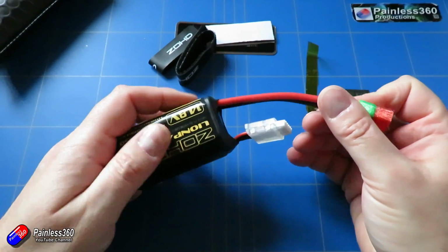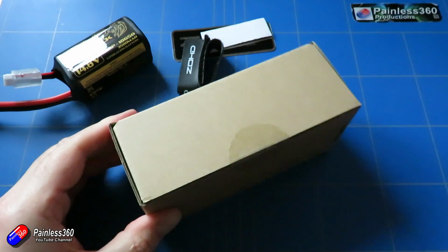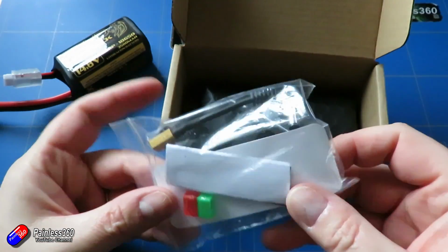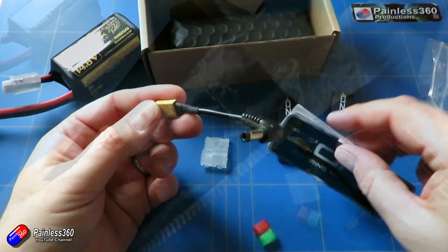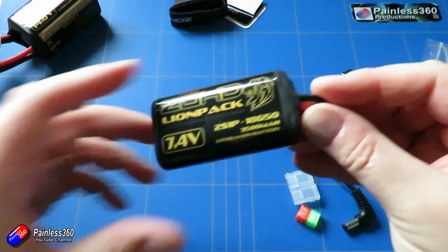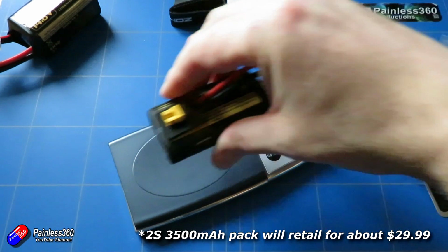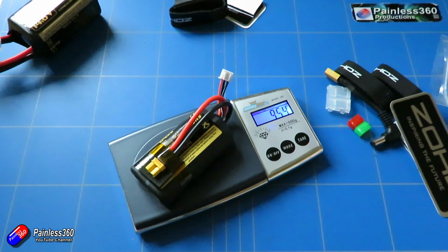There are a couple of things you need to be aware of if you're going to use lithium ion packs rather than LiPo packs. And that is the maximum current that you can pull from these packs is rated at about 10 amps, and that's a function of the actual cells inside these lithium ion packs that they're actually using. Now 10 amps is your continuous pull. Now on a large efficient wing or a smaller model, you're probably going to be cruising about the 3 to 6 amp range depending on how efficient your prop motor setup is.